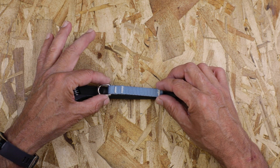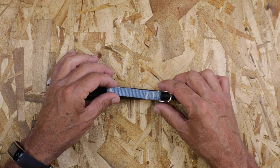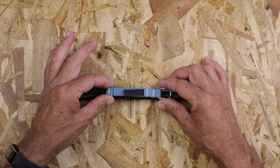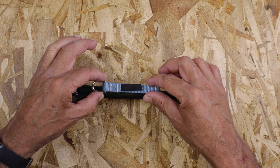The attachment's D-ring should be placed away from the tool's center of gravity and away from the functional parts of the tool. ANSI requires product labels bearing important details to remain visible, so keep the labels facing out.